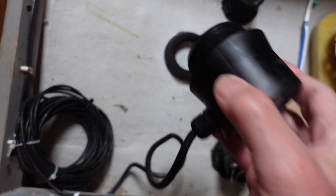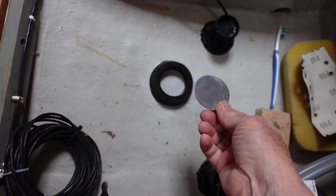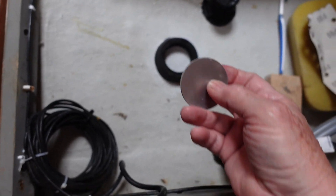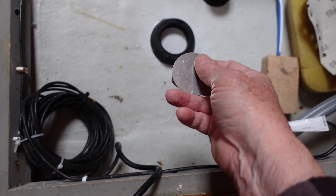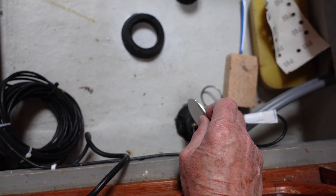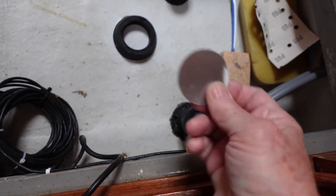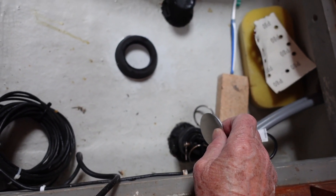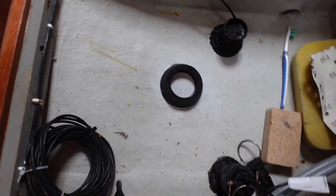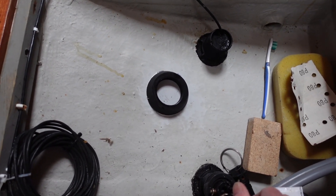Because the surface underneath is not necessarily flat, an option is to use one of these aluminium discs - you glue that in there, and then the transducer mounts against that with the jelly stuff that they supply. The next job is to drop that in there with a bit of epoxy on the inside, then we can screw the transducer on top and squash it down, and leave that for a few hours to set. I was a little bit worried about this epoxy because it didn't seem to be going off, but it's really firmly on there, and I have screwed the transducer in the top and it hasn't moved, so up to now we're doing well.